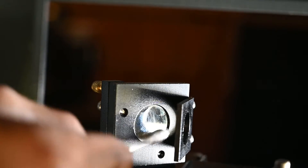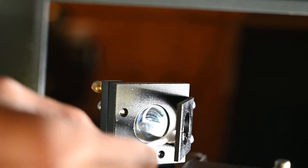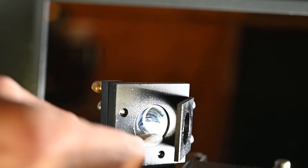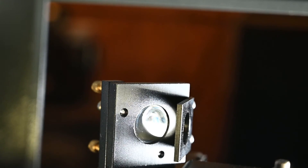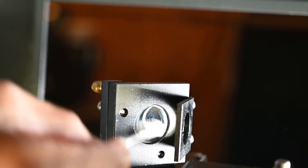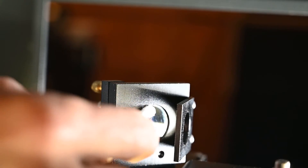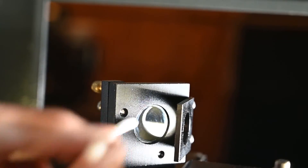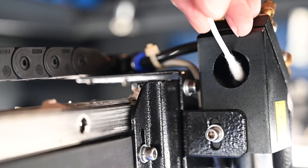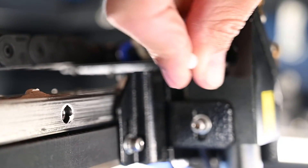With the light I can see we're going to need to do a better job on this one. Clean Q-tip. There we go. I can see there's a little spot in the middle — probably where my laser's hitting — and I've burned some soot on, so I may need to consider replacing this mirror in the not too distant future. And then last but not least, mirror number three — we're just going to come in here and give this one a nice little cleaning as well. And there we go.